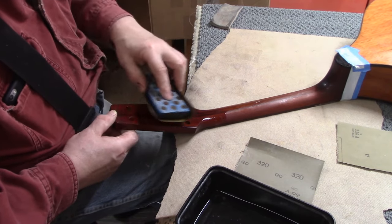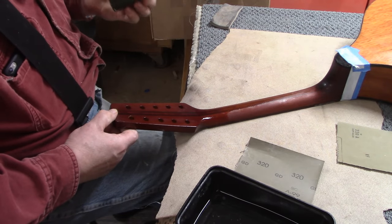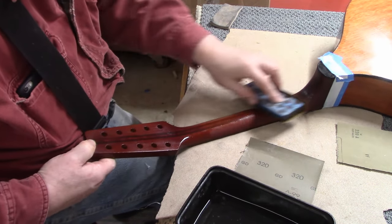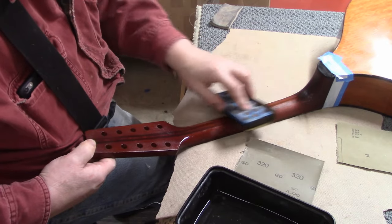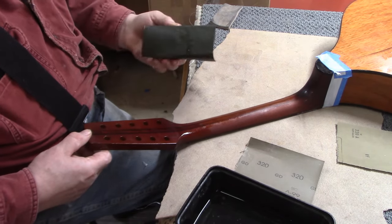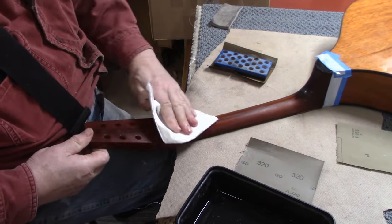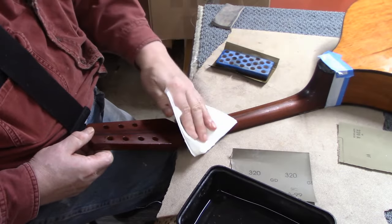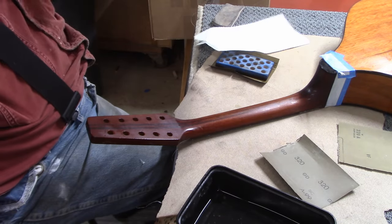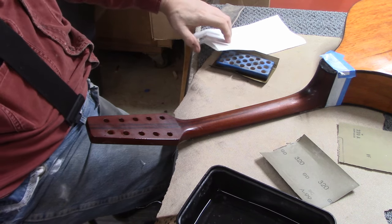I like sanding with the 220 to start out with, even though it doesn't really need to be that aggressive, but it requires less pressure, so that reduces the likelihood that I'm going to spot through somewhere, because I can sand more lightly. And like you said, with having put color in the lacquer, it just complicates any breakthrough. Right, yeah. So it sort of seems almost counterintuitive. You would think you'd want to use a finer paper, but the downside of using a finer paper is you have to be a little bit more forceful when you're sanding, and then you can break through, which is not such a good thing.